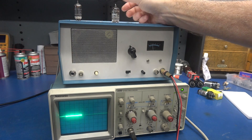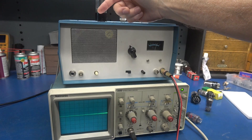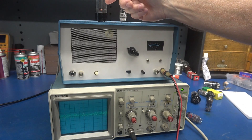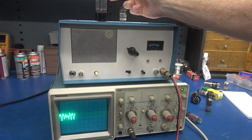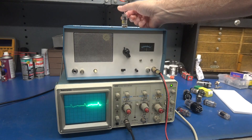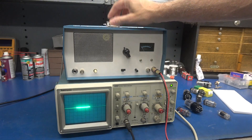Not as bad as side A though. Listen to that — it's like a little bell. Let me see it on the scope. Let's give it some more current and see if we can excite that even more. So you can hear that leakage — and there it is on the scope. Obviously you would not want to run that tube in your amplifier.